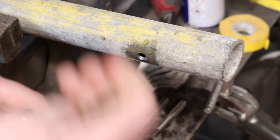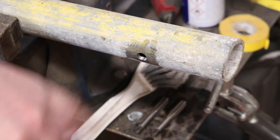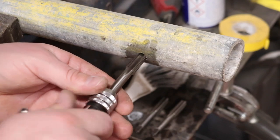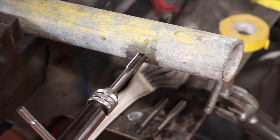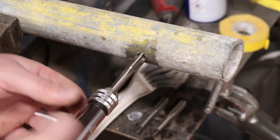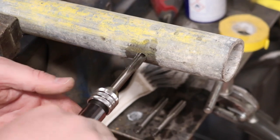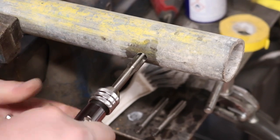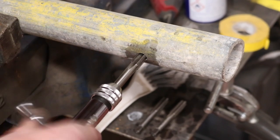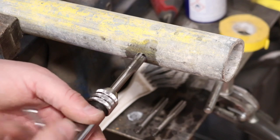So this one's the final cutting tool in these tap sets. There are three taps in the set, and I think they all have different depths of flutes to cut. Yeah, I definitely feel some work going on there. So this will be embiggening the hole. Make sure I turn back and just break the chip. There we go. She's moving. She's moving freely. That's nice. I think we're going to have cracked it this time, don't you, boys?